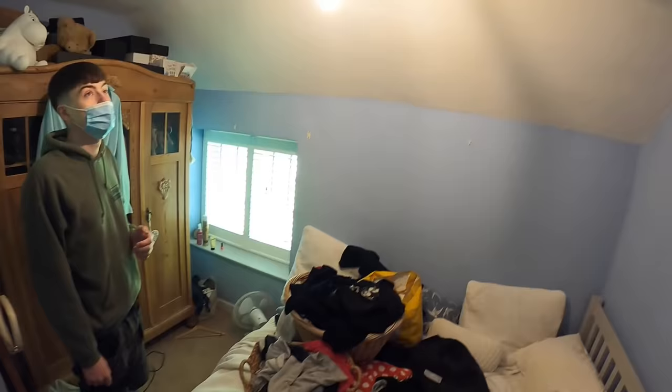I'll show you what this is. Have I been up this loft with a camera yet? I haven't, have I? So this is what we're up against here. Flooring, an asbestos tank, which we're not going to go near, and flooring basically. So what I've told the client is, we've marked up one, two, three for this bedroom. You can't probably see them, but we're going to have to drill it with a SDS, and then the end of the drill will poke through the flooring here, and then I'll have to come up here, or we'll just carry on drilling through, and that'll give us a gap for our downlight to poke through the ceiling, okay?